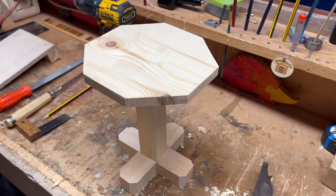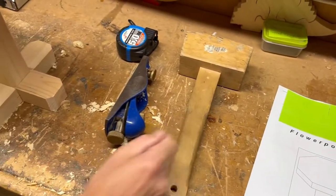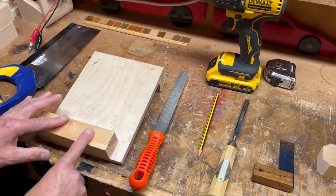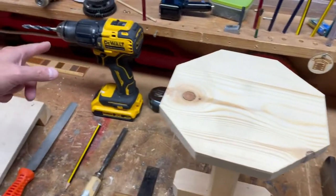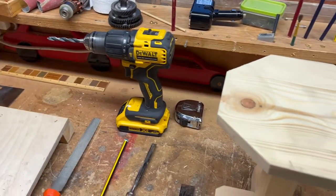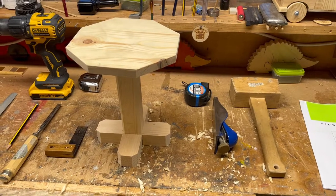There's our design. Tools needed are: tape measure, block plane, mallet, tri-square, bevel edge chisel, pencil, rasp, bench hook, tenon saw, woodworker's vice, handheld power drill and twist drill with a brad point bit. You could make that in about an hour — not much longer. I think it's a nice little project.